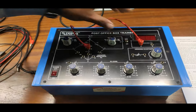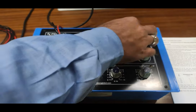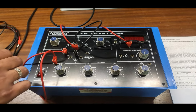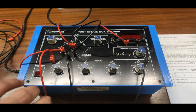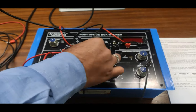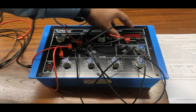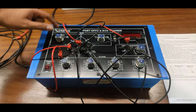We will connect the E point to the E point of the galvanometer and F point to the F point of the galvanometer. We connect the A and D points to provide the R3 decade resistances. A is connected to the A point and D is connected to the B point. We also connect the unknown resistance potentiometer Rx to the unknown resistance arm of this Wheatstone bridge. Now we will power on the trainer kit — make sure both switches are in the off position and all decades are at zero. Set the value to 1 ohm for both R1 and R2, then turn on the trainer board.